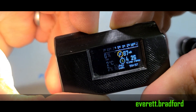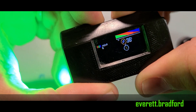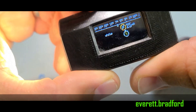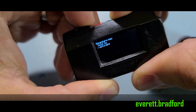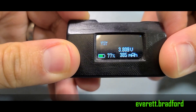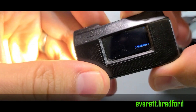In white modes there's a sliding scale at the top showing where the output is on the exponential dimming curve. In color modes it shows a scrolling list of icons for each mode. The display also makes configuration settings easy since it can show what they are in plain text. The display is also used with the touch sensor on top to show battery status without turning the light on. While charging, it also shows charge current, battery voltage, and counts milliamp hours.